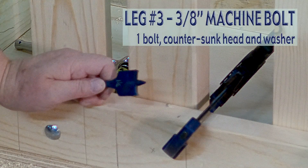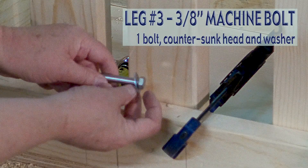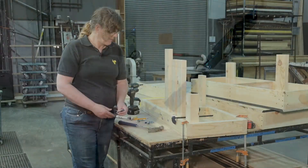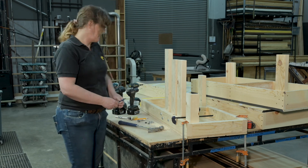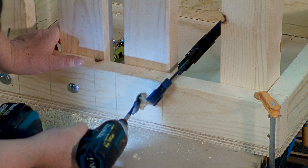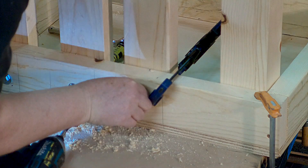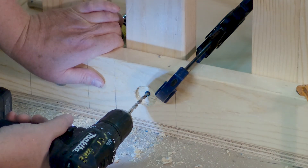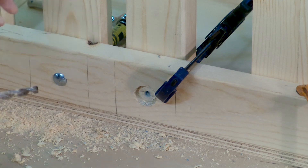I need a paddle bit, spade bit, or some other bore bit that is wider than my washer, because I need to countersink below that — deep enough to get through the thickness of the head and washer and get it below the surface. I like to start with the spade bit because that gives me a position to guide from. If I drill the bolt hole first and then try to do the spade bit, it will wobble around in the bigger hole and be a lot more inaccurate. I compress it, it flushes up. Now that I've got a pilot hole, that makes drilling out really easy, then I drill my 3/8 inch hole.